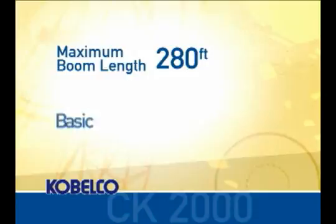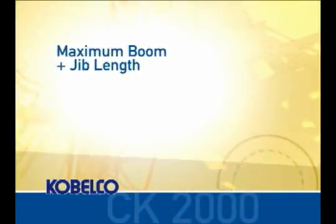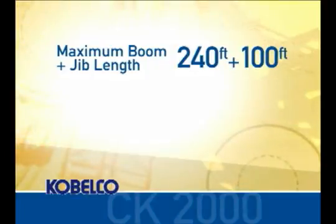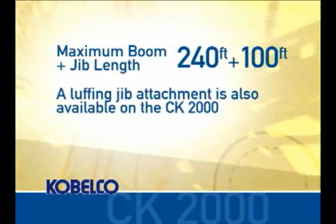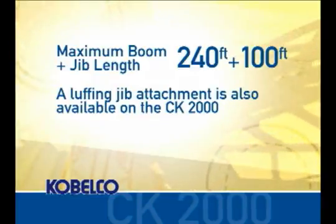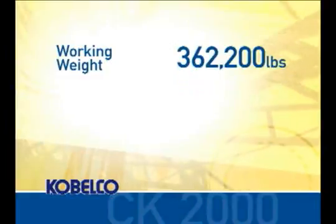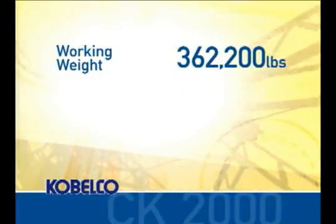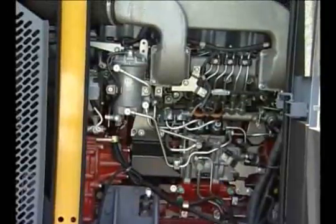This machine has a maximum boom length of 280 feet and a basic boom length of 50 feet. The maximum boom and jib combination is 240 feet of main boom with a 100-foot jib. A luffing jib attachment is also available on the CK2000. The working weight of the CK2000 is 362,200 pounds and is powered by a 331 horsepower Tier 3 compliant Hino diesel engine.